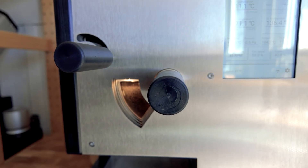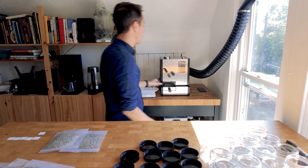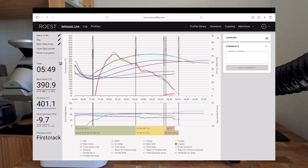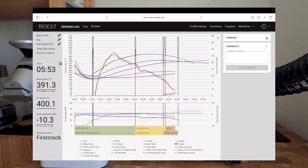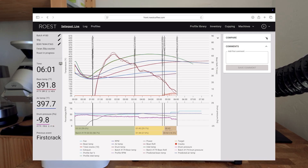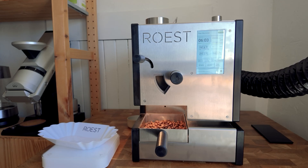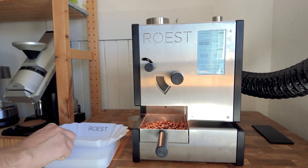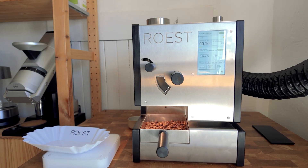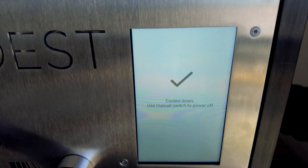Probes give us data to help us build an understanding of what coffee might be experiencing at any given time — and that is roasting. When we go from the L100 Plus to the Ultra we try to establish the same conditions: the same environment, the same pressure, and we adjust our inlet temperatures to account for that more efficient transfer. The machine performs really well and very consistently even with different coffees. And because I'm roasting with such lower inlet temperatures the machine isn't as hot, and I'm able to reduce the between-batch time from two and a half minutes to under a minute and a half — which gives me an extra sample or two per hour.